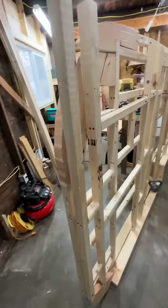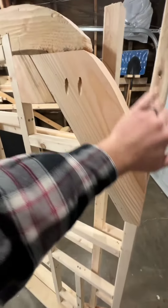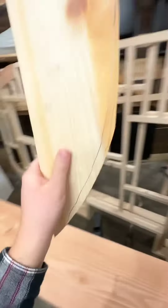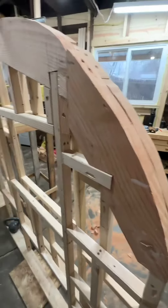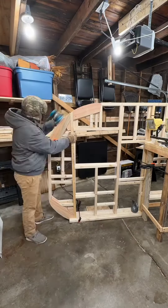Basically all I have left is the curves. I have them right next to each other to make sure that they are the same. So I trace this shape on this over here. I'm going to make sure it's right on this scrap piece of wood and then cut it out just like I did there. The wall is finished and they line up pretty close. The angle of the curves on both walls was just slightly different so I clamped them together and then went over it with my sander just to make sure everything lined up perfectly.